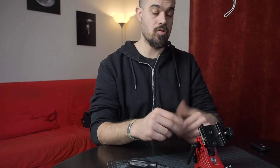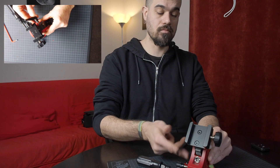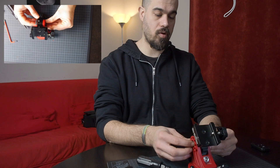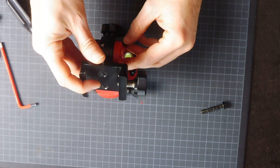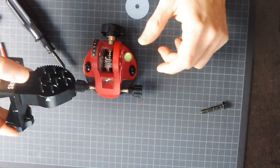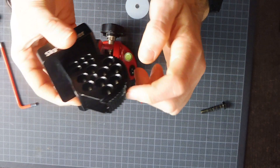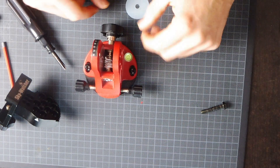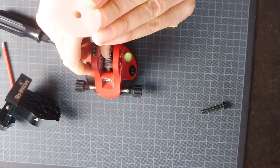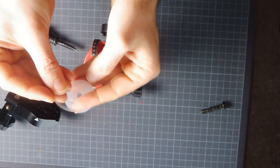Sometimes the washers wear out or break, and you need to replace them. Remove the lever and free the bolt — there is a washer here, just set it aside. You can now separate the top part of the wedge from the bottom part, and you can see how large the teeth of this mechanism are, which explains the play. The first Teflon washer is 0.6 mm in thickness. The other washer is a thinner clear plastic one at about 0.4 mm.